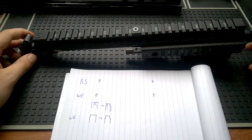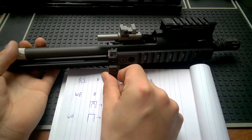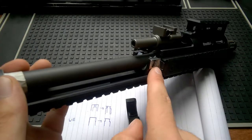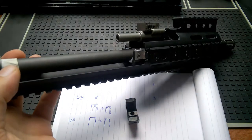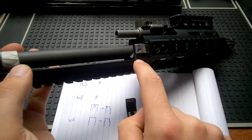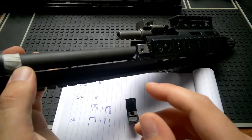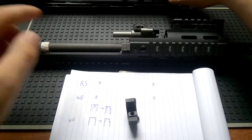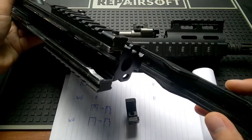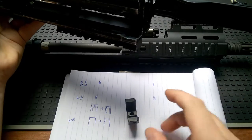The other screw — the front one — is a whole other story. You normally have the attachment block of the original one, as wide as the front part here. But there are two problems: the original one is that small, while the aftermarket one has nubs. Those nubs are extra material sticking out. The other thing is the area that I ground down — the originals were higher up, but they caused problems with my upper receiver. With those high areas, I couldn't slide this piece into my upper receiver. I ground them down and could slide them in easily, but the next problem arose.